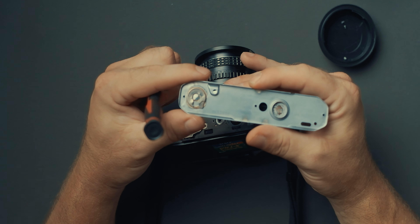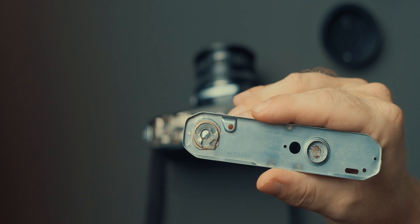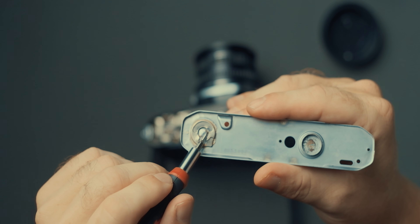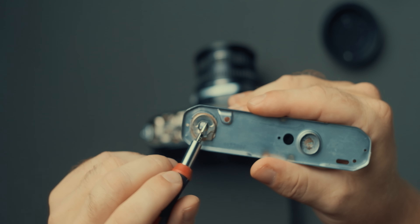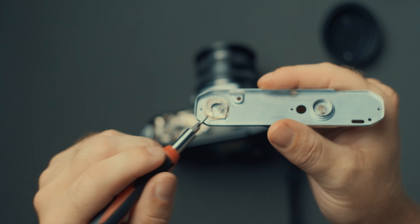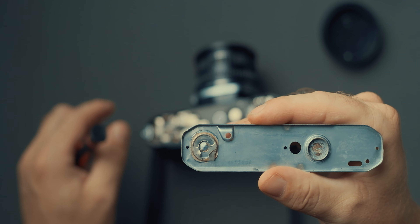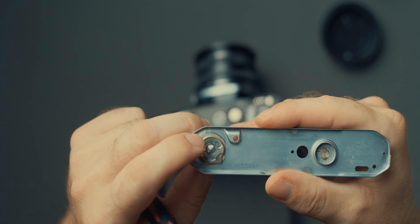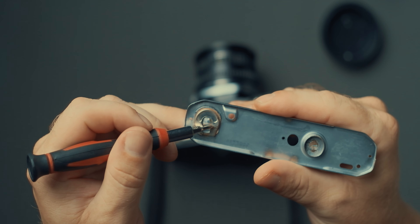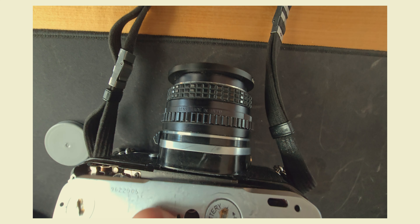What I did — and this isn't very elegant — but I just took a little screwdriver and gently inserted it underneath this horseshoe-shaped little contact point down here, and gently pried it up and away from the base plate to kind of make it stick more into the actual camera, to give the little connectors in the camera a better chance to hit this actual contact point. I did that on two sides just to get it somewhat even and away from the base plate.